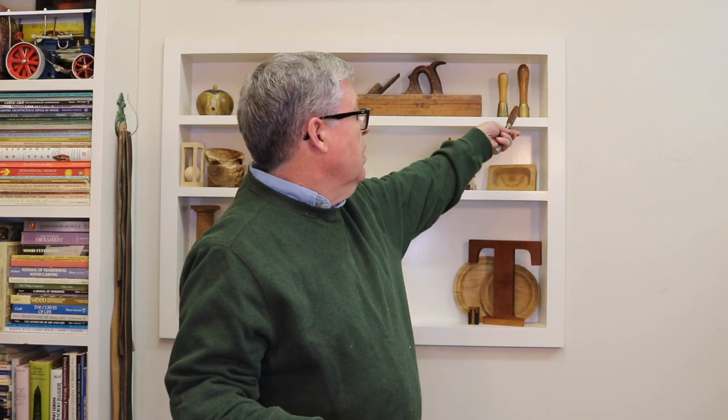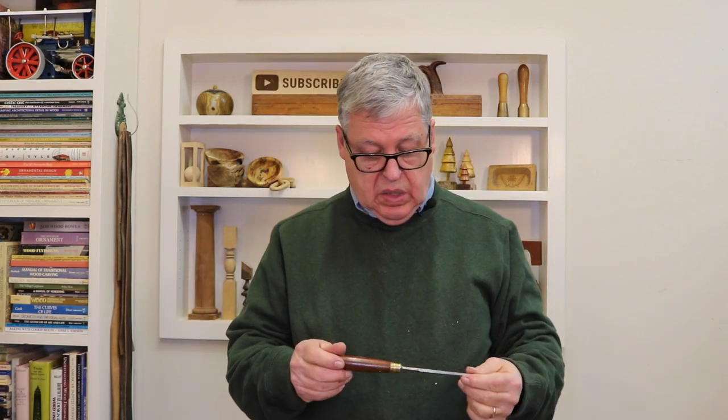So that's it for mallets and why wood carvers use them — it's because you can control the direction and pay attention to what you're carving, because your tools are moving around as you're working. The small ones, particularly this one here, I use a lot because you can tap it. Sometimes people use the palm of your hand, but that's not good over many years. Well, that's all I've got to say about why I prefer round mallets. This is the first video for the new year and I wish you all a happy new year. If you like it, please give it a thumbs up, please subscribe, and we'll see you next time.